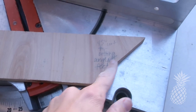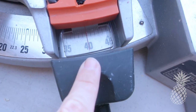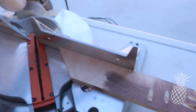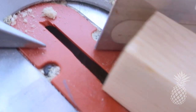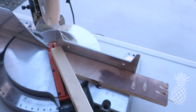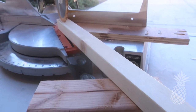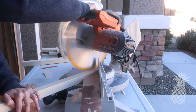I found a safe way to cut these angled feet, because that was the one area that Andrea, a DIY wife, kind of left out — she just does it by eye and by hand each time. But I created a method so that I could get the same angle safely every time. You start by making a template board, cut it to exactly 45 degrees. Then you move your miter saw and set it to 40 degrees. See how they're lined up just like that. Now when I put my piece of wood in there, it's going to shave off just a sliver, giving us the perfect angle for those furniture legs at the very bottom.